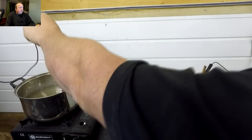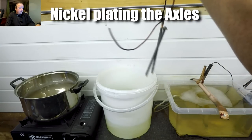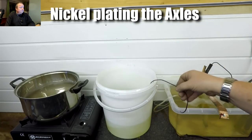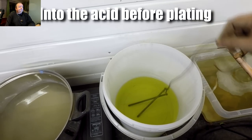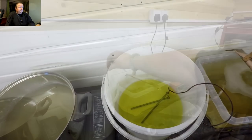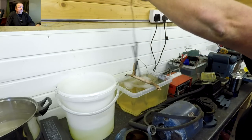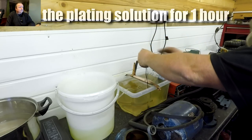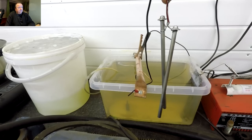This was an old Galeros nickel plating kit that I had — I still have it actually, but I haven't used it for a long time and the chemicals probably aren't great now. There's a pickle first, then it goes into an acid clean, then into the plating solution. You only put it in for a set period of time — these are very toxic chemicals, folks. There's a copper bar and also some nickel bars in there as well. And as you can see after the allotted time, it comes out nicely nickel plated.